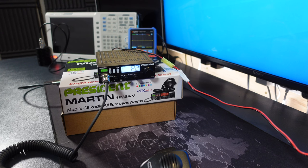Because I will be asked the question — what is the highest output power of the radio when in standard mode? Well, we're in the services menu on the PL adjustment, the power low adjustment. Let's see what the radio is capable of doing without switching to modification. The setting 7A is giving 6.1 watts at its highest. And we need to return that to 6F at 3.87 watts.